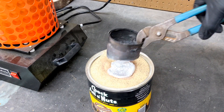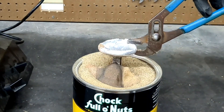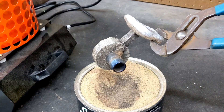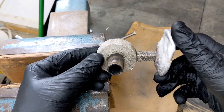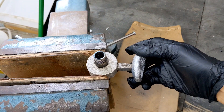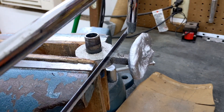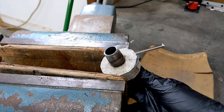So we're going to wait about 15 more minutes or so and then remove the aluminum from the sand that we just cast to see what it looks like. In the beginning of the video, you saw it did work. Now we're going to be doing some tests, because that's really what I wanted to find out. Before we start doing some tests, I want to cut off that sprue, which is the area that the aluminum flowed into the part.